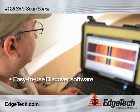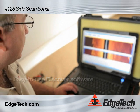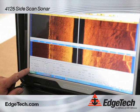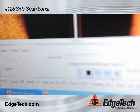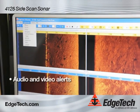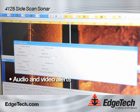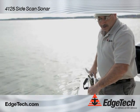I'm going to explain a little bit about the Discover software. We designed it to be very easy to use, yet have all the features that somebody would require. To turn it on, you simply go to the towfish control tab and check the sonar on for the high frequency and the low frequency. You can use either one or both at the same time. Recording the data is as simple as going to the disk tab and checking the record box — the files are automatically recorded at this point. We also have alerts that can be set to alert the operator if he is too close to the bottom. We have a minimum altitude alert, a maximum roll alert, maximum depth, and maximum pitch alerts. Now we are ready to put the towfish in the water.